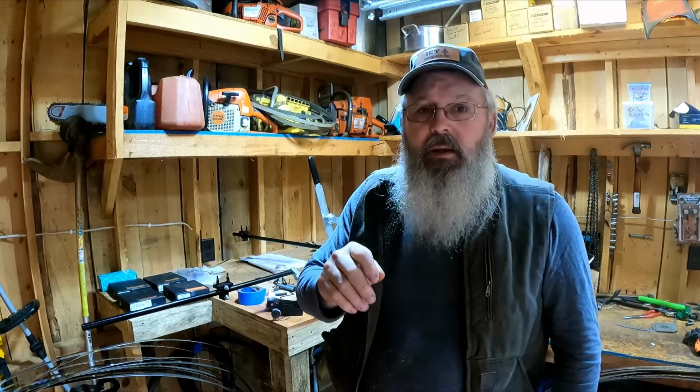When I'm sawing on my mill, I'm going down through there, looking, of course, to make sure I'm not going to hit anything and that I'm getting the cut I wanted. And I'm looking at that blade, because there's a gap between the side of the log and that first guide roller, usually a couple inches right there. I'm looking at that. If it's bright and shiny, perfect. If it starts looking a little gummy, you're getting pine rosin, you're getting sap. You can get it out of oaks around here. Poplars, normally not a problem at all, but any of your pines, white pine, loblolly pine, Virginia pine, name them all, they're all sappy at certain times of the year. But even oaks around here can be a little sappy. So keep an eye on that as you're sawing. Keep that mess off, and that'll make your blade perform longer.